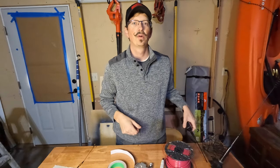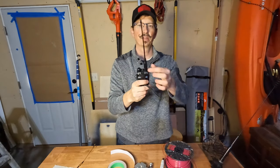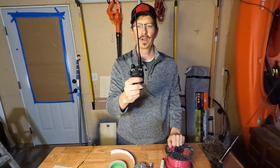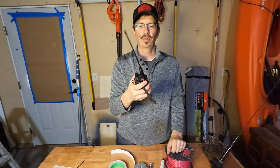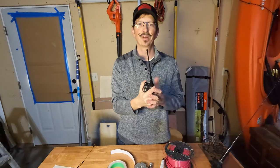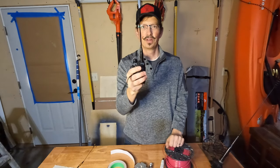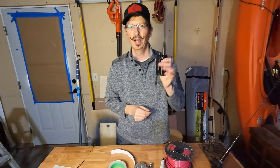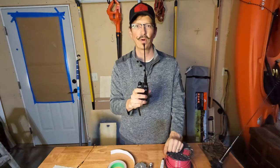One of the most popular vertical antennas in terms of volume is going to be off of a handheld radio — a HT. That's just a vertical antenna for VHF, UHF, etc. Your ground plane is basically either the frame of the radio or your hand once you grab it. You're coupling to that and creating a ground plane for the signal. Just about everybody has one of these — it's the vertical antenna in its simplest form.